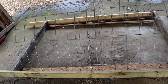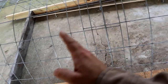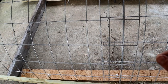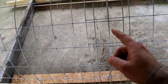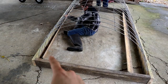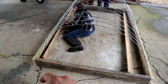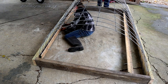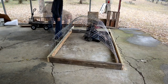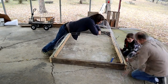As you can see, these eight-foot panels are slightly overlapped right here. The reason they're overlapped is twofold: one, we could have gone all the way out where it's four feet in each direction but that would have left nothing here. This is allowing some stabilization between the two, because remember they were not cut with steel at the very bottom of the whole rung. This is going to hold it all in place — it's just a little more stability so the pigs don't beat it up and spring it out. We're bolting from this side through to the outside; the nuts and washers are on the outside, and the inside has the rounded carriage bolt head so there's nothing to poke the pigs.